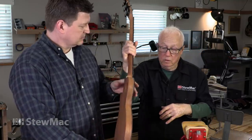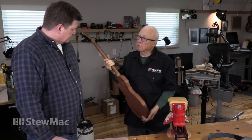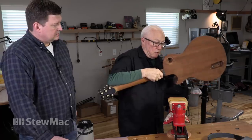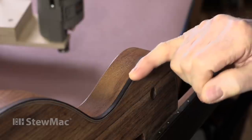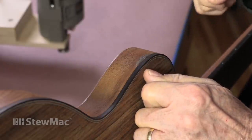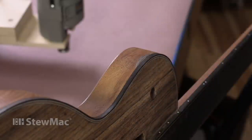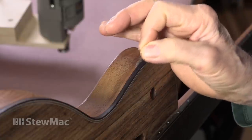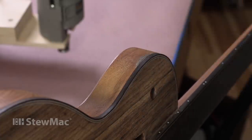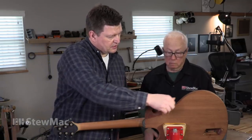I think it's a really cool guitar. You wouldn't want to paint over that — I'd put wood in it. I would use a saw and a chisel. I would saw right along the binding with a little razor saw, then come out here with the saw, saw there, chisel it out, and put a piece of wood in there. Try to find one that would match the grain, and you could make little pock marks with a pen to give the pores of the grain, then shade over it — just enough to hide it but still let all the grain come through. I love that. Let's do it.